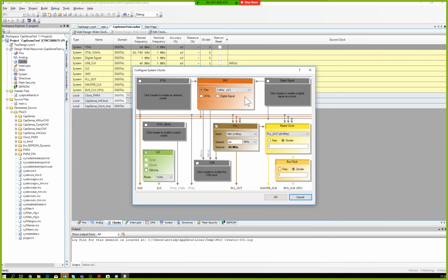And of course, one thing would be just crank up the speed. Here you go. If 3 megahertz is not fast enough for timing, we can just click it to 74.7 megahertz. So that would actually give about that divided by 3, roughly more than 20, about 25 MIPS processing. So that's actually quite fast, or anything in between.